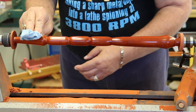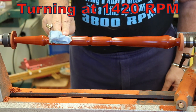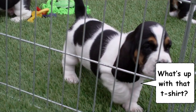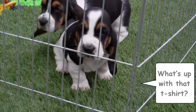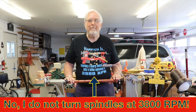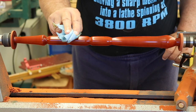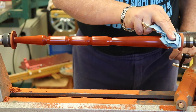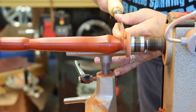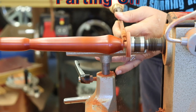This finish really shines up nicely when the lathe speed is increased and friction polishes the wax and the shellac. I make sure that I polish every surface, especially between the beads. After applying and polishing the finish, it was time to part off the shoehorn handle with a parting tool. While the parting tool is used for a lot of other things in turning, this is where it got its name — this process is called parting off.